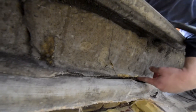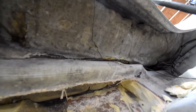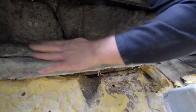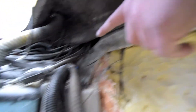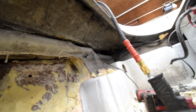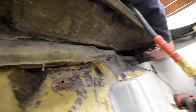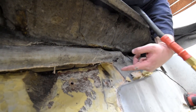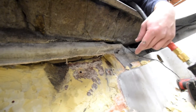The piece that came out of here wasn't doing anything — literally just a single piece of fiberglass put in there. I'll probably put it back; I'm not really sure what it does, but it may add some structural integrity to the top of the boat. I'm going to get in here and chip all of this out on both sides. I'll cut up right there, and that's where my mold will be — I'll mold all of this to pour in carbon core transom material, then pull the mold off and glass it all.